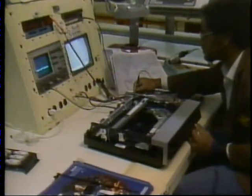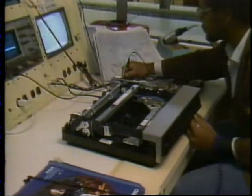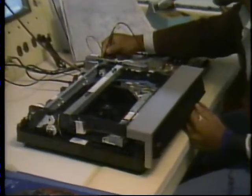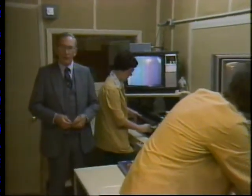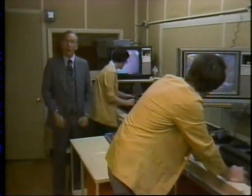If a certain tolerance begins to waver, it may be time to make an adjustment at a previous production stage. Life tests are conducted separately — sample players are taken from the line and subjected to 500 hours of continuous play. This helps assure that all the components and parts will perform at the optimum levels expected of them. Each player's final quality check is conducted in a shielded room at the end of the stop station line, where color quality, picture stability, and audio performance are all monitored.